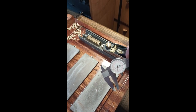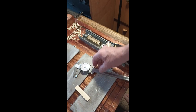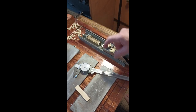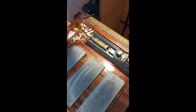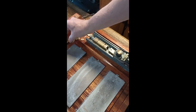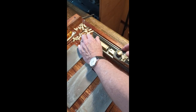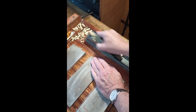It'll take a while to sand from 0.4 down to 0.2. So what I'm going to do is loosen all of these and slide the block just so that it's a tiny bit higher. I loosened these guys about a half a turn each, and there's a block under here that I slid back to lift the entire thing up a tenth of a millimeter or so. Then I tighten them back down. Now we're coming in right at 3.25 approximately. I'm going to see that the center is lined up and do another one.